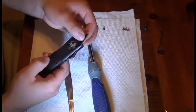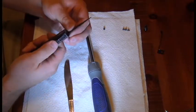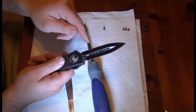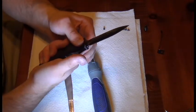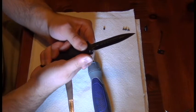If you want to test now, with two screws in tight, you can pull your blade — push your button up all the way to the top, pull your blade to the top and out a little bit. Be careful because the sharp edges are here and here. Now the knife is actually ready to work. I'll still hold down on the halves just to make sure everything is straight, but you should be able to open and close your knife now.